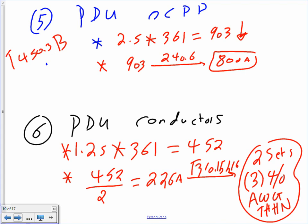Could you fry the conductors? No, because the conductors are protected on the secondary. This is the primary. The secondary is protecting them from overload too. So whatever comes from the primary has to go through the secondary. If you protect the secondary conductor from overload based on the ampacity, and you overload the transformer, the secondary protection will trip open. In this case, it will protect the primary, right? Because the current has to go through the primary to the secondary. If you have good protection in the secondary, the primary is protected from overload. That's kind of the idea. But I want to warn you that in real life, probably this will be much lower. But for the test, let's keep it this way, the max. I want to write the max. Max. Okay, so that's all we care about for the test.